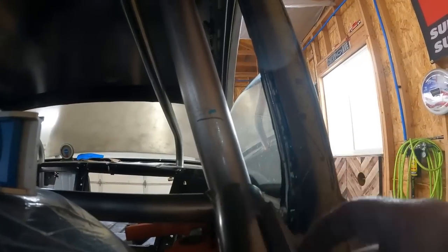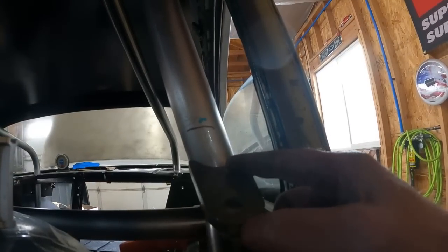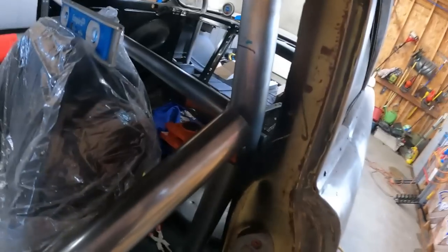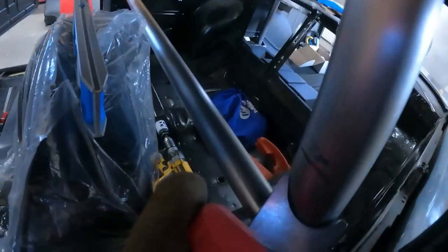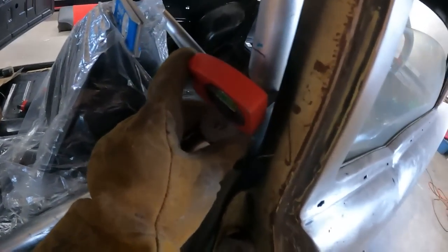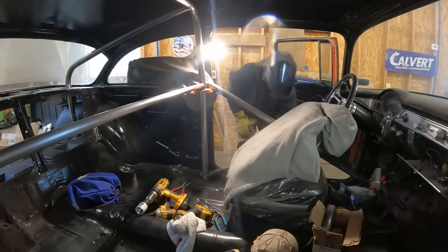Now I'm trying to figure out the placement and angle of this little guy. I have the bar clamped a little lower than I need it — that'll be mid-bar once in place, which will raise the bar up to where I want it. I've got some marks on it, I'm going to hit it with the grinder. I'll clamp down there, clamp up here to give me my angle — I had to grind out the back of this a little bit so it'll fit on the tube. Once I put a level on it and get it where I want, that tab is going to raise the bar up half a bar width, putting the bottom at approximately the top of the cross bar.